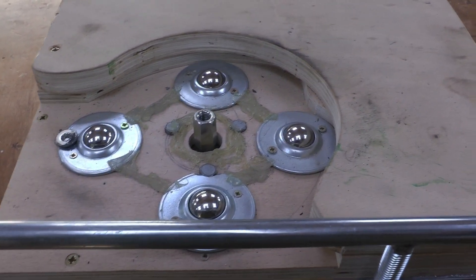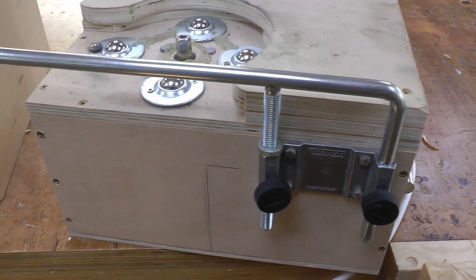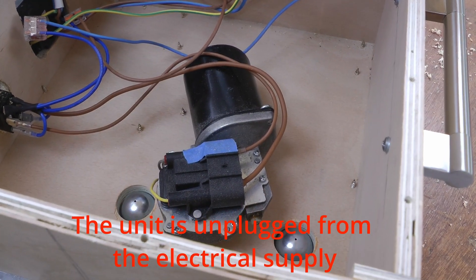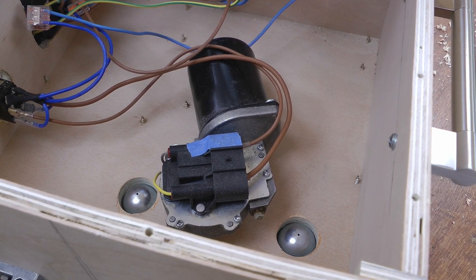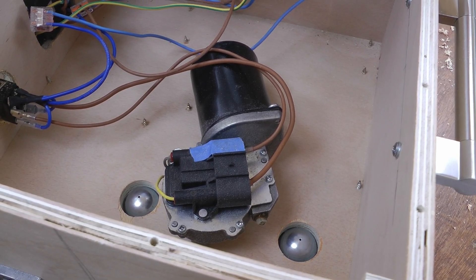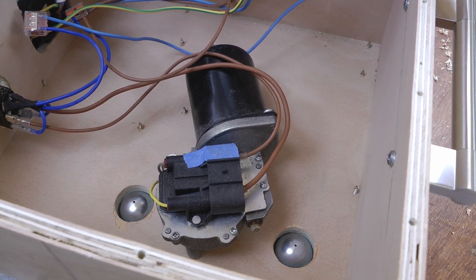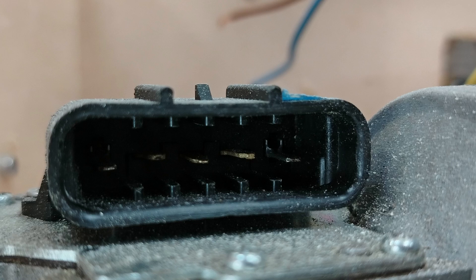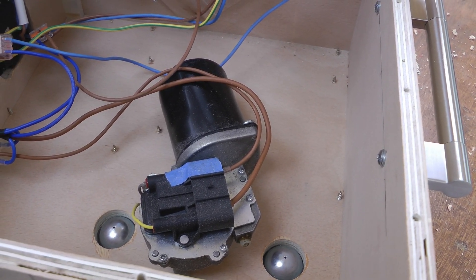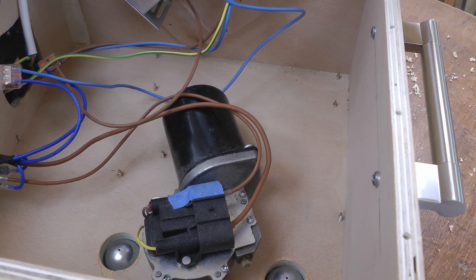That said, I have found I don't really need it. This is actually a Tormek tool holder, and this is a Record tool rest, but they're all very similar. The motor is a windscreen wiper motor — these are relatively cheap. I paid £20 for mine off eBay, a second-hand one. Easy to mount; it's got a screw thread on the spindle so you can bolt things to it quite easily. They're robust motors and being 12 volts, generally a bit safer for the electrics. The motor has five pins in the plug. Attaching the 12-volt supply across these gave different speeds on some of them; some didn't appear to do anything, so those are probably related to intermittent functions. Having the fastest speed is what I've gone for. For some reason the motor runs faster in one direction than the other — I really don't know why.